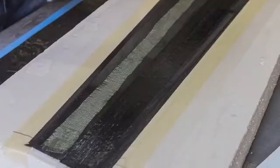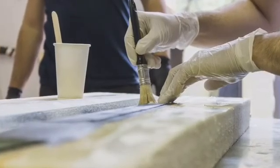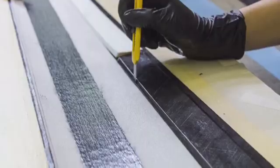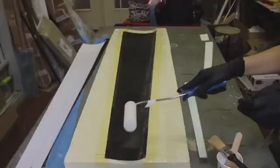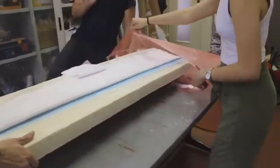We also treat the molds with specific chemicals so that they don't get damaged after the removal of the components. For some components, like the tail, we used positive molds, with the peculiarity that they remain embedded inside the final pieces. In order to create the positive molds, we assembled our very own hot wire foam cutter, and then used it to cut polystyrene in the desired shape. Once molds are perfect, we are ready for laminating our composite components. This operation must be carried out with great accuracy, since each composite part is key for all structural properties. When the resin is dry and we open the vacuum bag, we separate our components from their molds very carefully, trying not to damage anything in the process.